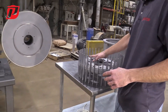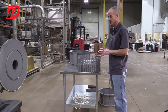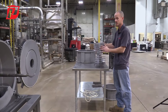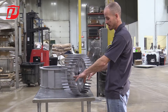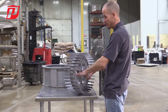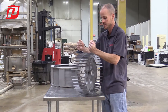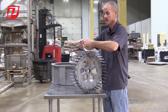Now that we have the rotor tightened down and know there are no loose blades, we can go ahead and install it into our fine grinder body. We want to be careful and safe while handling things. On the M51 the rotor is not that heavy, but as we get up to our 76 and 101, the rotor is going to be a lot heavier where you're not going to be able to grab it by hand. With our fine grinder rotors we have a teardrop design in the rotor, and as we get bigger you can come in with a forklift to pick it up, or you can put a strap through — paying attention to the blades so we're not putting any tension or possibly bending the blades, making sure the strap is between the blades and not coming into contact with them so we can properly lift it.